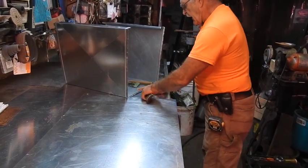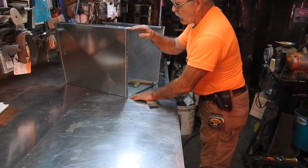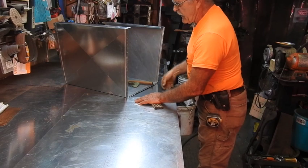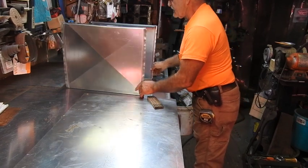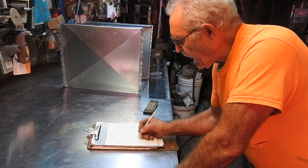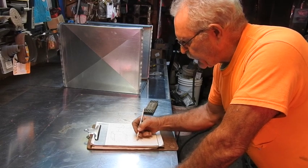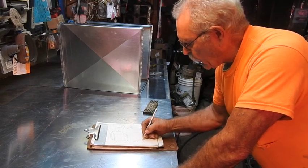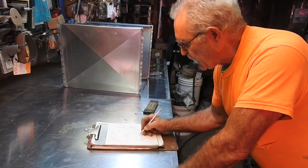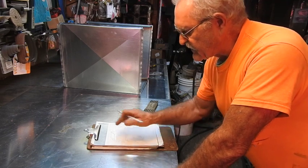The dimension on this should be 17 and a half inches wide. 17 and a half plus a quarter plus a quarter is going to be 18 inches wide, and it's going to be 18 inches tall. We have to add a quarter, so that's 18 and a quarter plus two and a half for the two-inch and half-inch bent down. So 18 plus two and a half plus a quarter — 18 and two is 20, so 20 and a half plus a quarter is 20 and three quarters, by the width which is 17 and a half plus a quarter plus a quarter, so that's 18. Two cut sizes: 20 and three quarters by 18 gets us our two plugs.